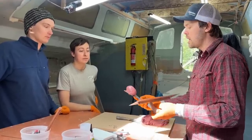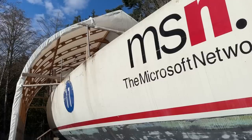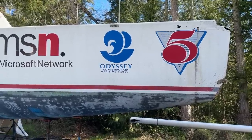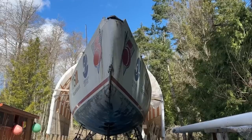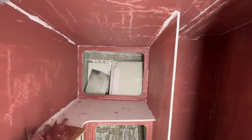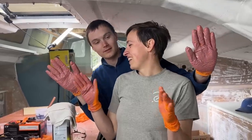If you take a big glob like that and wipe it across, you can kind of fill the whole blade. I'm trying to remember how you did it — distributing it along the blade. Matt is a professional. This is not as easy as he makes it look. I intentionally had Alex and Marie skip the corners. The next step is to sand the whole head, and afterward I will go over the corners with more fairing — so I'm not fairing both the flat surfaces and the corners at the same time.